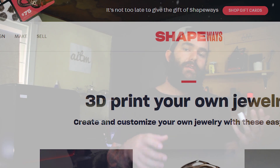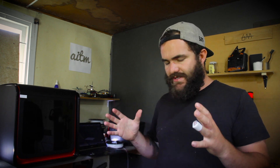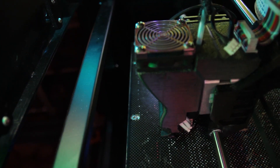Before we got one of these, we were printing everything in nylon SLS from Shapeways. As you can imagine, that was quite slow — you'd have to order, wait for it to come, and it's quite an expensive process. With ABS prints at this scale, there's really nothing else like it in its class. There is still a slight bit of warpage with ABS because of the scale, but the enclosed chamber, perforated bed, heated bed, and print speed really make for something that just can't be beat.